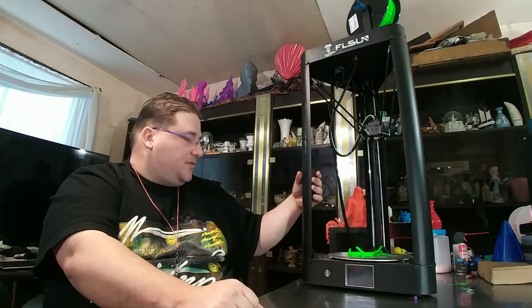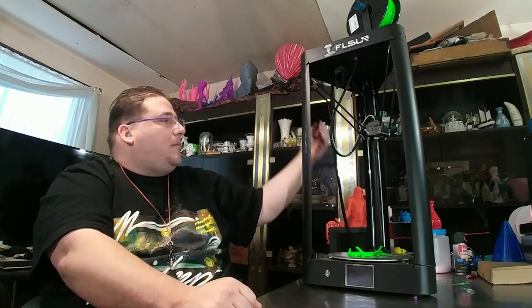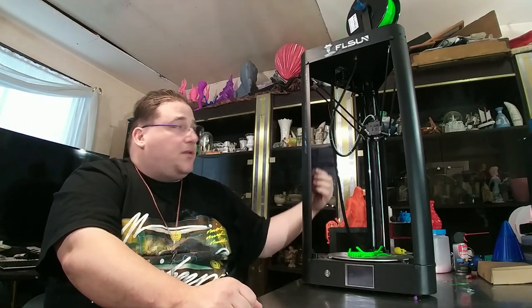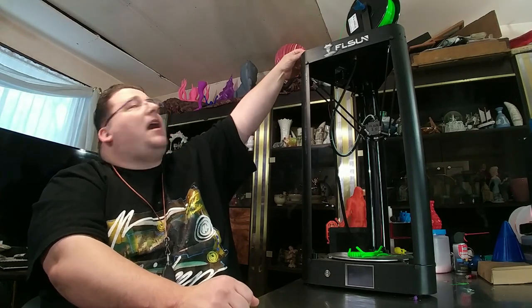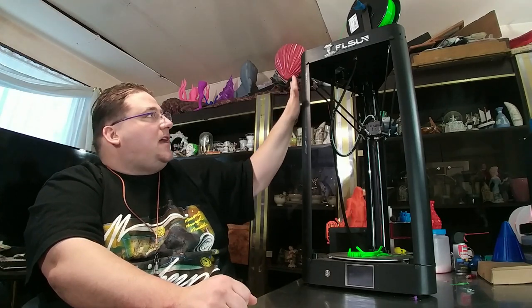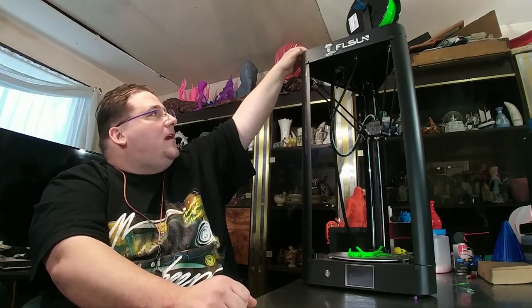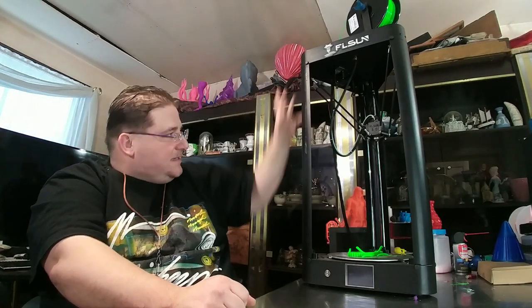It's a little more involved than that just because there's more screws. It's not harder, there's just more screws. You know, you have two here, two here. You have the screws on top, which grab a hold of these belts. So the pulley wheel is already attached to the belts. You slide it through the top, and there's a hole on the top here, and a square hole that receives the unit that you slide up through the top, and you spin the nut on it. And when you tighten down the nut, it pulls that unit and tightens the belt assembly.